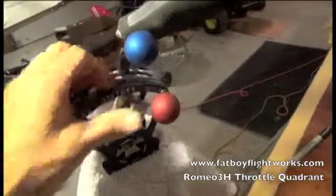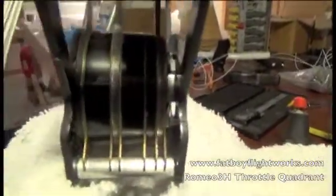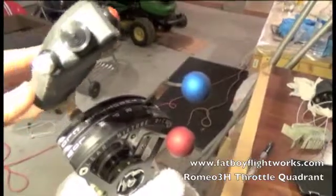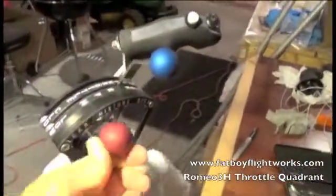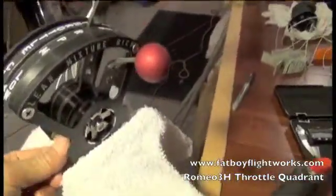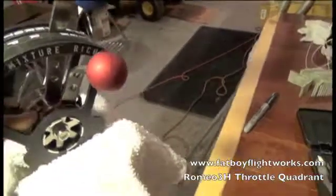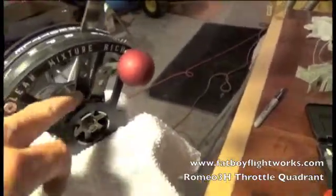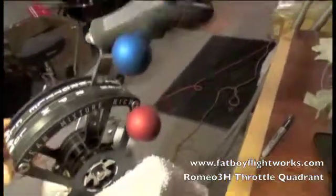Yeah, so that's a look at the throttle quadrant, and maybe a little bit closer in here you can see the drum. You can see the spacers and the shims wrapping around either side of the lever so that you have complete independent travel. So if you're pressing either lever, the other levers are not affected by the travel. They're real smooth. For the full complete travel, there's no difference in feel, there's no pinching at all, and no levers will creep on you. They're completely independent, and that's the beauty of getting the shims wrapped around the lever, and then of course you're spaced out with the Delrin spacers, and because it is a circle lever wrapped around the drum, they're about half inch in width. You've got a lot of surface space for the whole tension aspect of it, so it's a very, very smooth travel as opposed to like a 1/4 inch through bolt.